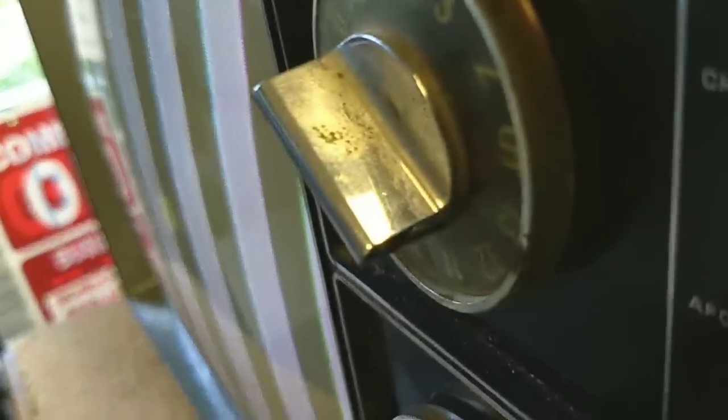Alright. Nope. It's still touchy. Now, if I turn the setup switch, flip the setup switch one way, I got no color. I don't know if that's how it's supposed to be. You can get close. But it never wants to stay in the right spot. And I know for a fact that that's the wrong set of colors. If I turn the tint control one way or another, you get close. But it ain't right. So, something else is still going on here. Not sure what.